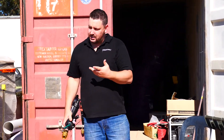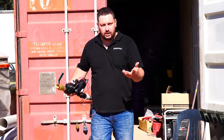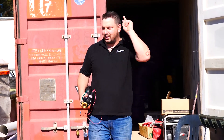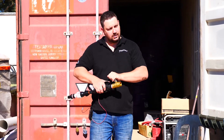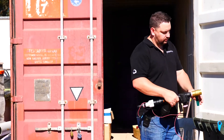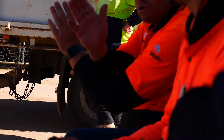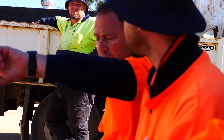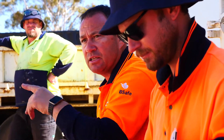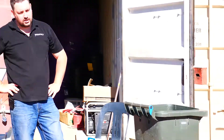When you've got multiple cable runs — say two runs of 13 core going down a trench — use duct tape in the valve boxes to note which wire loom is which, because that cable might be going off to a different area. Open the valve box and you don't want to cut the wrong green from the wrong run. We make sure wiring comes into the box and back out again so you can see where to cut and which side to cut on.